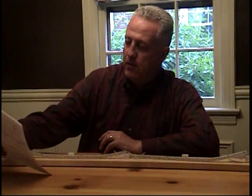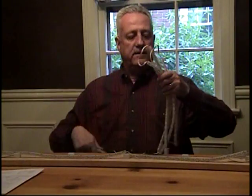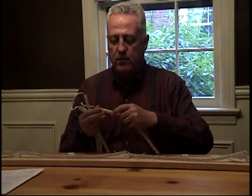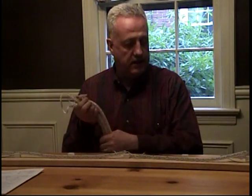It's shown in the sheet, however I understand not a lot of people are reading the sheet, so they want me to do a little video to show how it goes together so that it's done properly and doesn't come out looking like a bunch of spaghetti or a lot of shadowing. Now, the unit itself comes as eight feet, but it's actually six 16-inch sections, and it's cuttable every three inches. There's a little notch in the back — you'll see there's a black chip and then two white — and you go to the back and you can feel it; that's where you cut it.